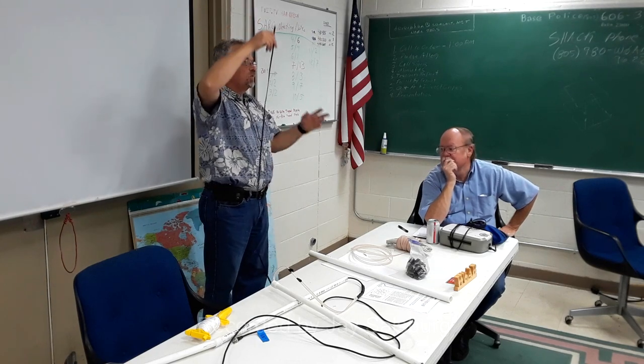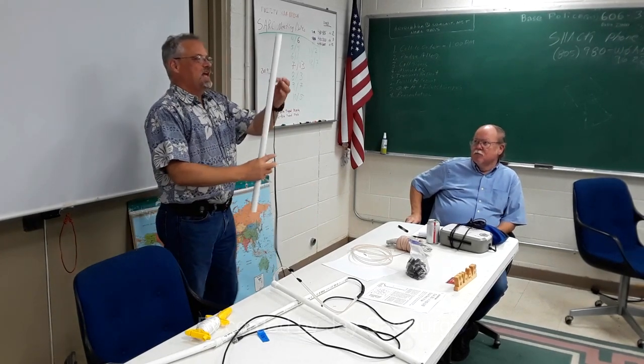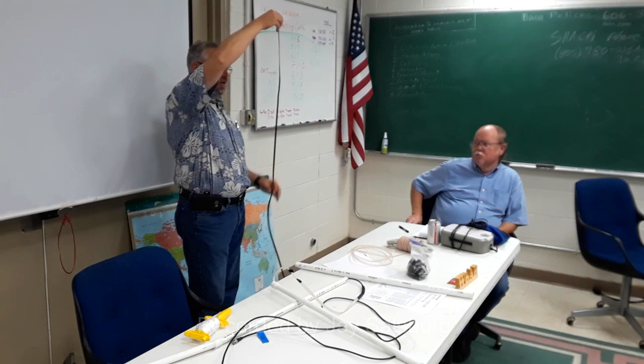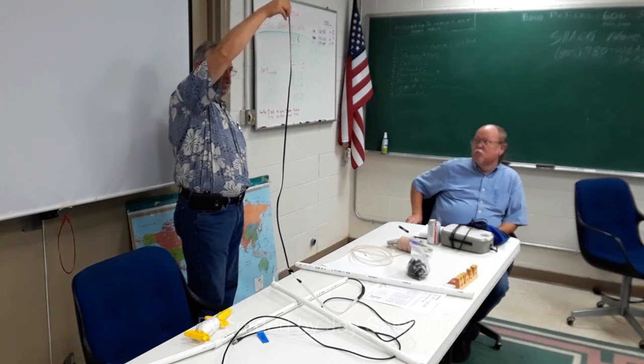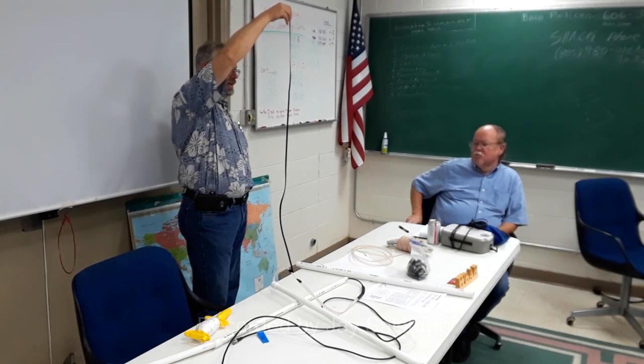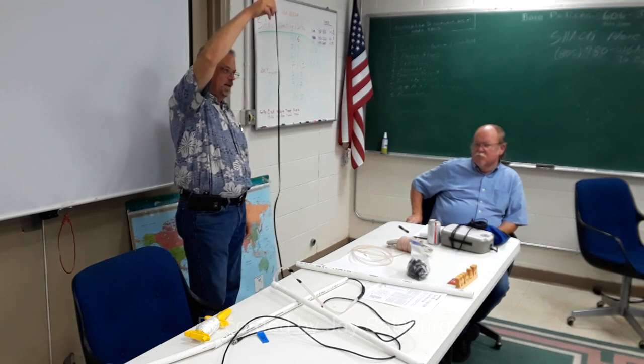And so when we tune it, we have to tune it. And by the way, mistakes, I'll share my mistakes with you. You can't tape it to the outside of the PVC pipe because this will detune it. So I have a piece of wood out there that we can suspend it from so it's not right up against the wood, but next to the wood, okay? Then we'll tune it off of that, okay? And I have it set up so you can run it up and down like a little flagpole, okay?